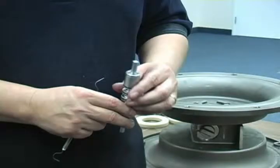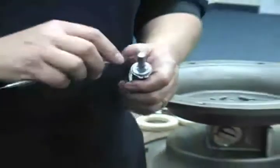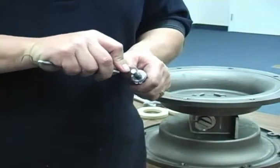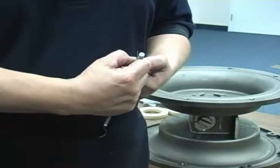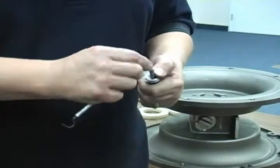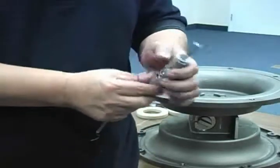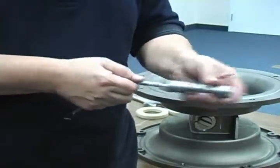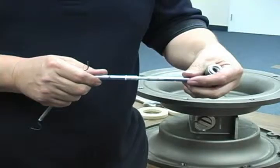To inspect the anti-double shift O-ring and the pilot spool seals, you will need to remove the retaining O-ring on the opposite side of the small indentation at the end of the pilot spool. You may now remove the pilot spool from the sleeve. Removing the spool in this fashion will prevent damage to the anti-double shift O-ring. If the spool has been immobile for a prolonged period, a compression set may cause the spool to stick in the bore. A light tap on a solid surface will free the spool.